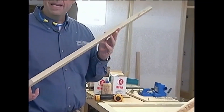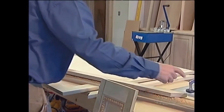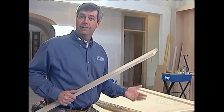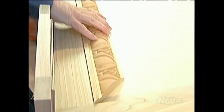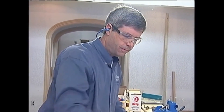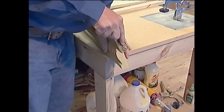The way that I do that is by cutting a piece — this can be any scrap piece — that's going to fit inside the length that the molding should be. Then I'll take that piece and lay it on the actual piece of molding and just slide it back and forth until I've got the same match on the profile on each side. It's a lot cheaper to cut a piece of scrap and get things to fit than to be chopping away on an expensive piece of molding. I'm also going to take my block plane and just slightly put a little bit of back relief on these miter joints.